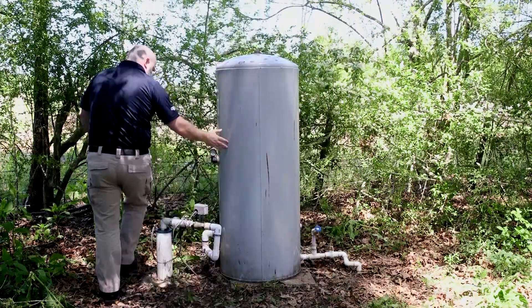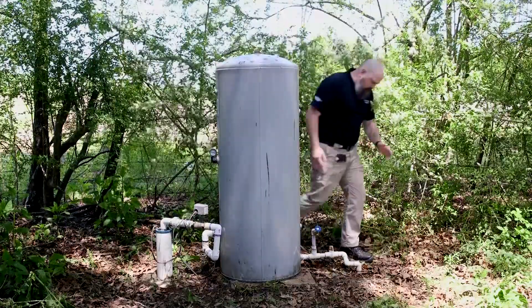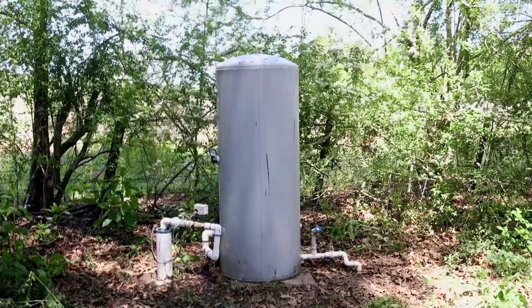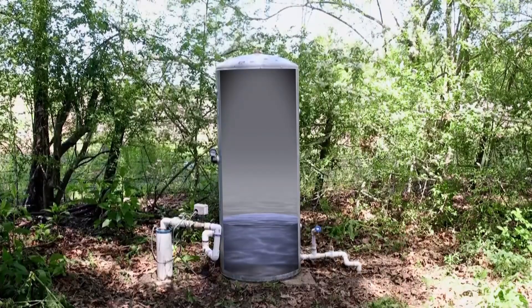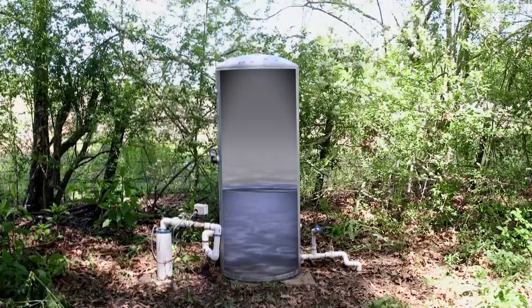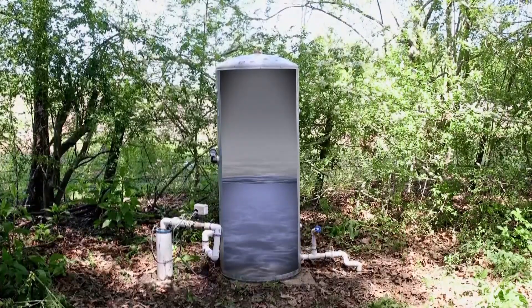Check and make sure your tank is also in good shape — no damaged pieces, no significant rust, cracks, or leaks. As that water is pumped through the well pipe, it will go into your pressure tank. Your tank is going to fill partially with air and partially with water. It does not fill completely with water. This is so the air can push the water from the tank into the pipe and into your home.